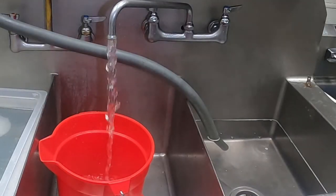Now that we have all the equipment we need, let's go over the procedure for cleaning the syrup lines. Number one: fill a bucket with 2.5 gallons of water and one packet of K5 sanitizer.